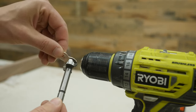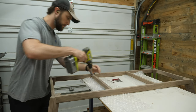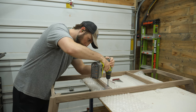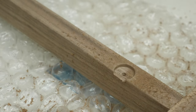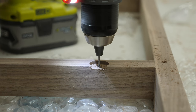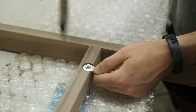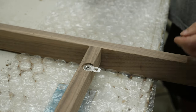I find that these are one of the easiest ways to attach tabletops. Just grab a Forstner bit that is slightly larger than the figure-8 fastener and chuck it up in your drill. Then drill out a small area that's biased towards one of the edges of the interior braces. Afterwards, drill a small pilot hole for the screw to make sure that you don't split that interior brace. Now you can drive the screw in to secure the figure-8 fastener, and you can see that it is freely able to pivot side to side.